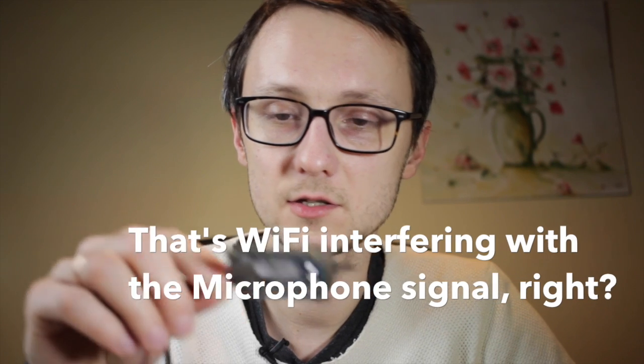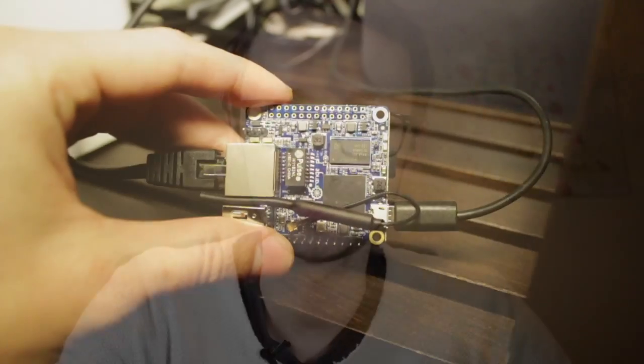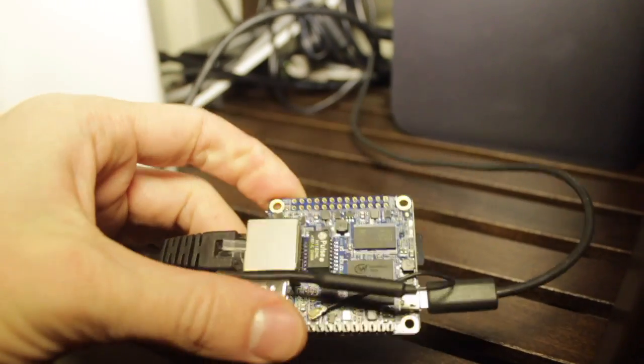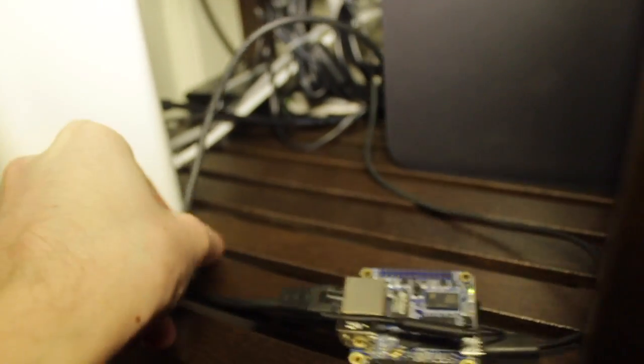I was running this with Armbian stable release, and Ethernet works excellent. It's 100 megabits and it's actually able to send and receive data for long periods of time at those speeds, which is impressive. I have it connected straight to the internet and it's serving a website that I'm hoping to use for hosting videos of this blog, as an iTunes podcast. With only the network connection enabled, it consumes around 100 milliamps.